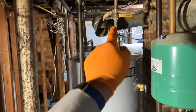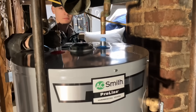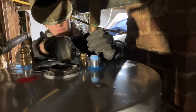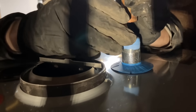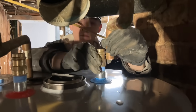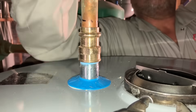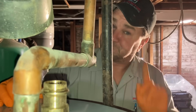We're going to throw two three-quarter press-by-female adapters on the inlet and outlet. We'll press them, clean up the existing copper lines with emery paper, and tighten up those male adapters. If you don't show and tell, you didn't do it. Mikey Pipes, you didn't deburr the pipes.